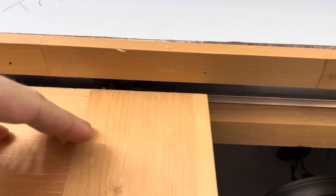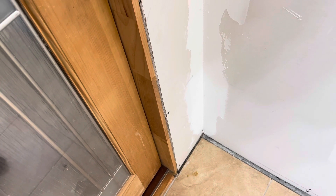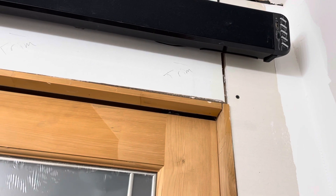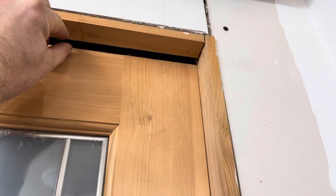You tighten this, so you effectively raise this side up. The reason why you're doing that is because the door would be off-level — it would look more like this when closed. See the gap there? That's what you would have. But because I raised the front part of the door, you don't have that gap anymore. And because I lowered the track here, the door self-closes. Since this is lowered, this piece here will be wider, and then this side over here is inconsequential, because once I put the finishing trim up here, you won't even know it's there.